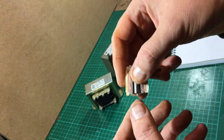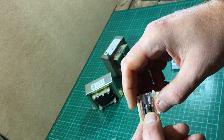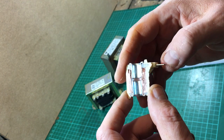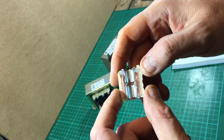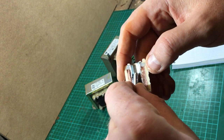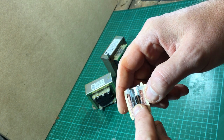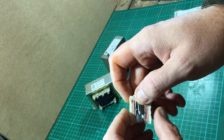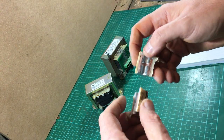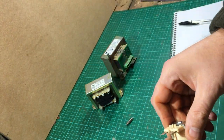Inside that liner goes this iron core. This iron core is connected to the valve seating, so as we put voltage on here, these wires — because they're wrapped in a coil — induce what we call an electromotive force, which actually drives this slug up in that liner using electromagnetic force. That's how this particular valve coil operates — quite simple.